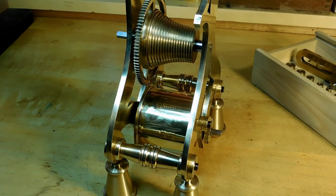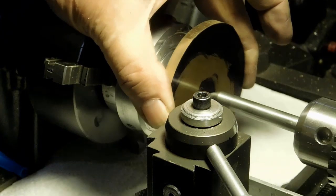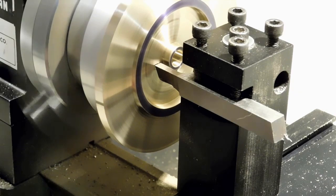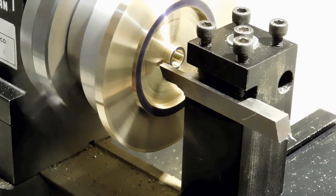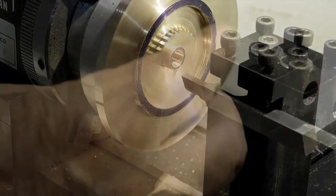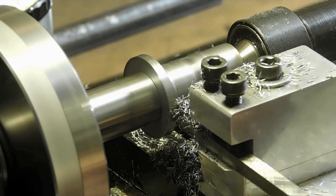So for right now let's go ahead down into the shop and get started. Here's the beginning of our ratchet cut, and there's the finished ratchet. Now we're putting a gear blank onto a super glue arbor and facing the front of it. That little spigot in the front is going to be the arbor to put the ratchet on. Let's check to make sure we've got the right size — there we go, so now we've got the ratchet in place.